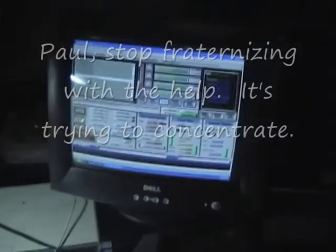Here's this little setup over here. There's the power supply — it can put out about 7.3 amps. There's the Gecko. Thanks Adam, you suggested such a lovely little thingy. What is this thing? It's a controller for the stepper motors — X, Y, and Z axis. That's what those three plugs are. It gets the signals from the computer, right here.